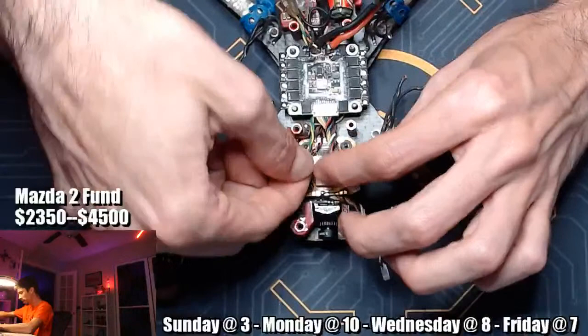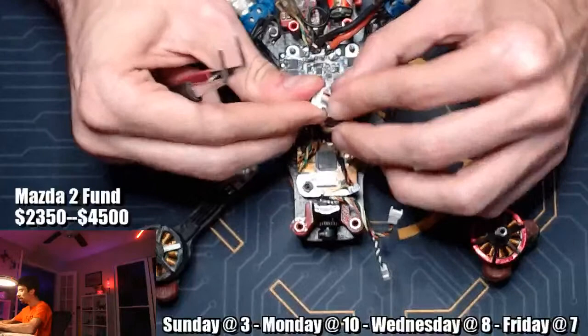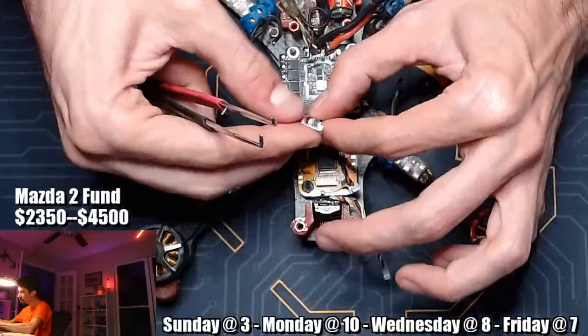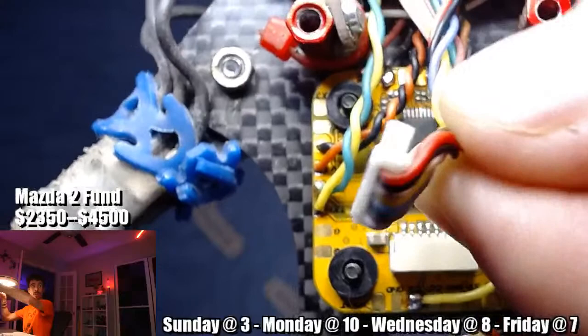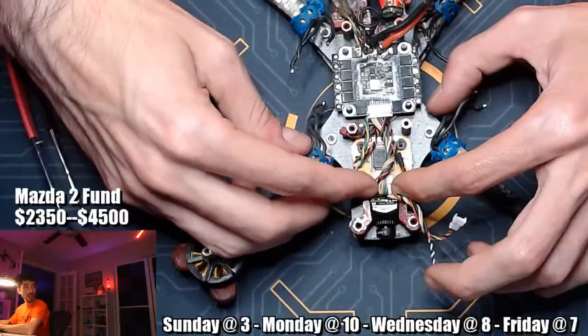And what I like to do is I'll grab the wires on the back like that with this tweezer. Well, so here's the other thing. Allow the wires to make a 180 right out of the plug. Keep the twisted part from going all the way to the plug base. See what I'm saying there? So let the cable do a 180 like that with the wires flat. That's what you want. You want the wires flat so that they can make the quickest little 180. And then when you do that, it becomes a little harder to plug it in, but that's okay, you'll get it. Just sneak it in there, and get it buried in that plug header.